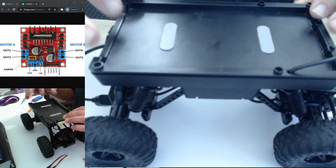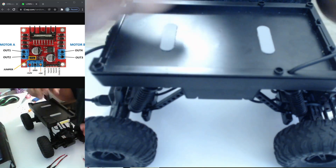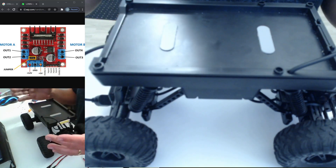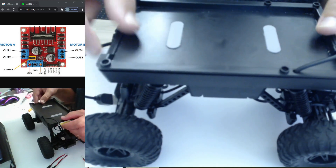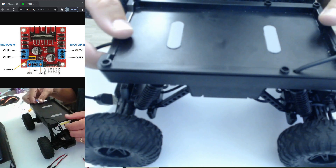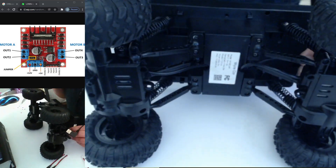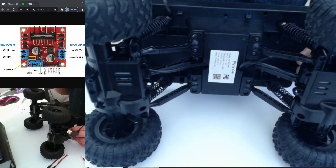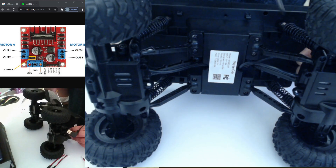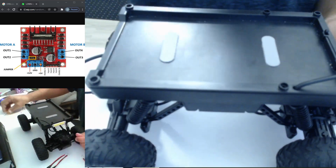All right, so you've got your Wyze car. We're going to take off the camera and take off the rack — that's simple — or if you just got it, the rack is already off, and that's basically where we start. You'll notice there's a flatbed screwed on top. Undo the six screws: one here, here, and here on both sides — in the middle and then the two ends. They're basically the only screws holding it on.